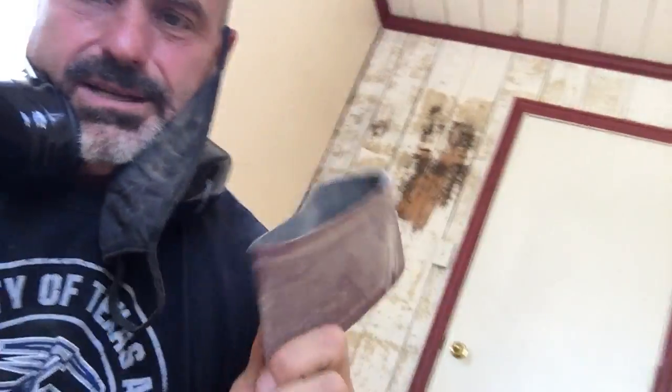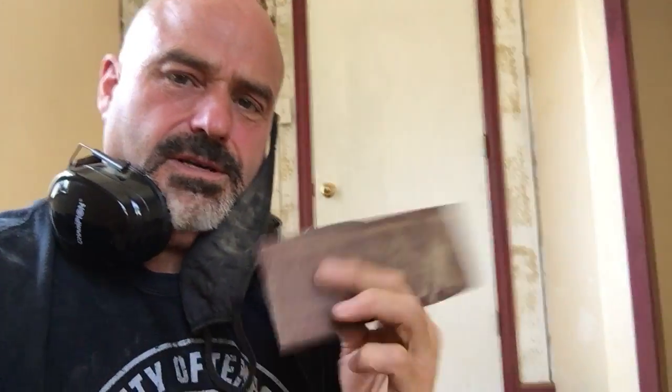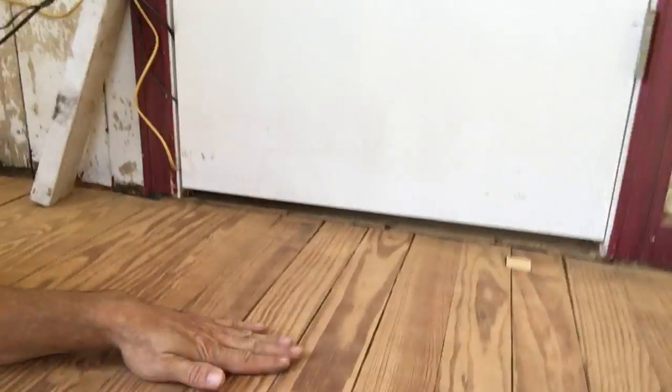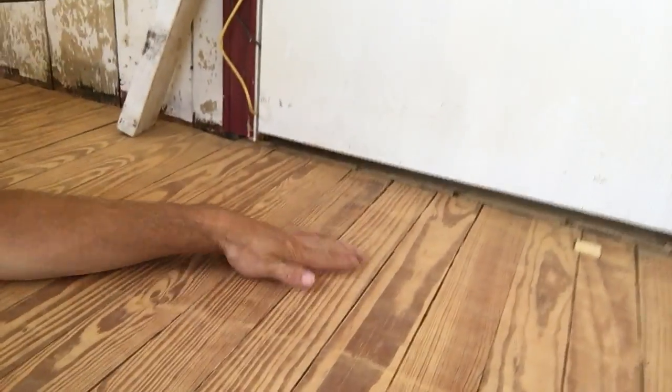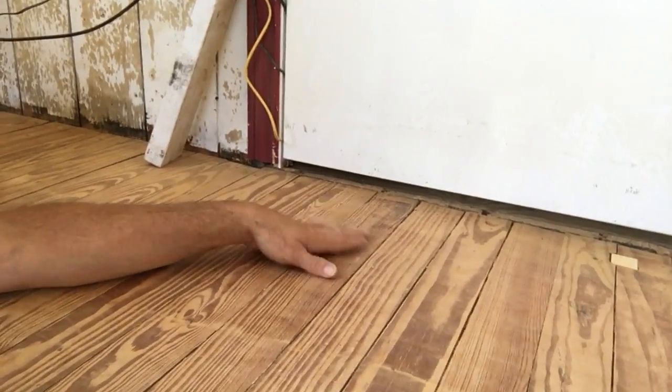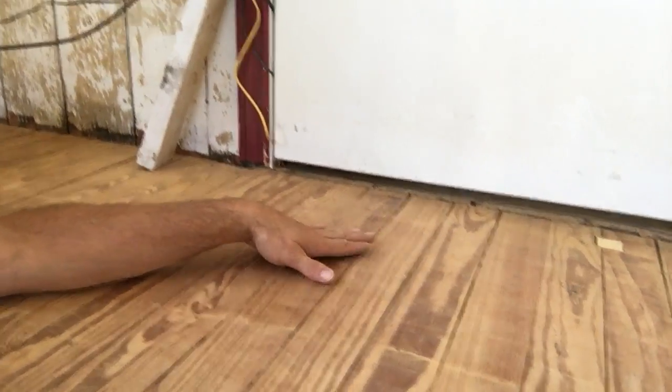And I noticed that with the 120 grit too. And I tried a couple different things. I thought I was applying the pressure wrong or something with that belt sander. But what I finally did was I took off the old belt and I put on a new one. And I can see now it's starting to sand more smoothly. And while those are still there, it's still taking them out.